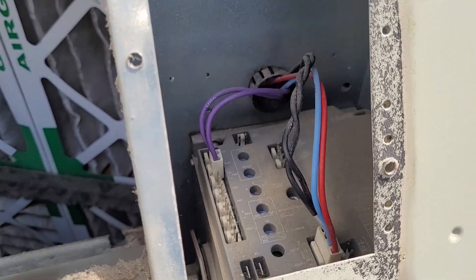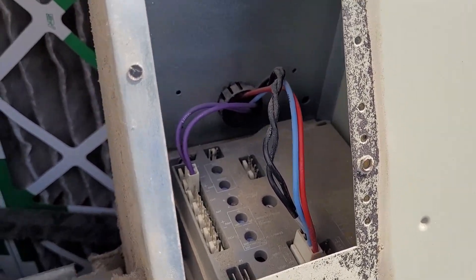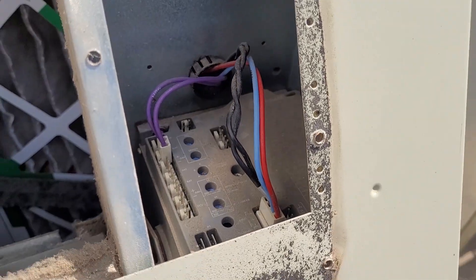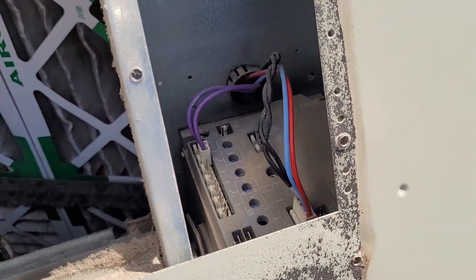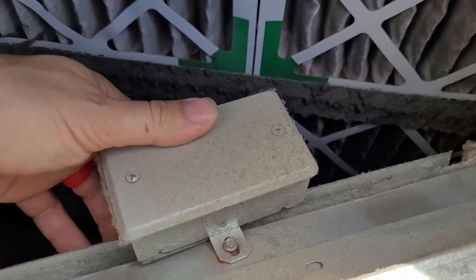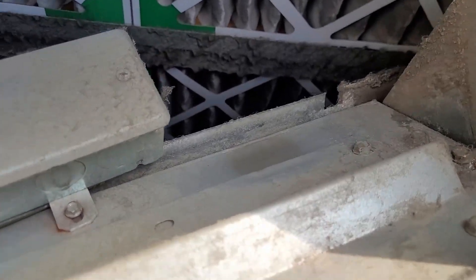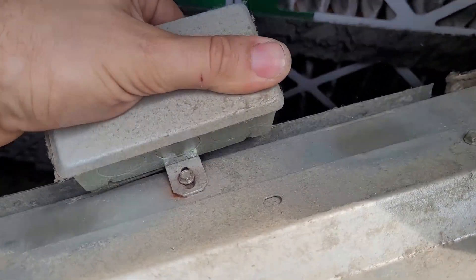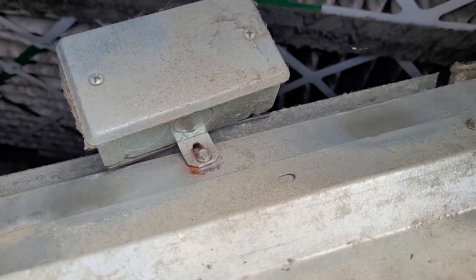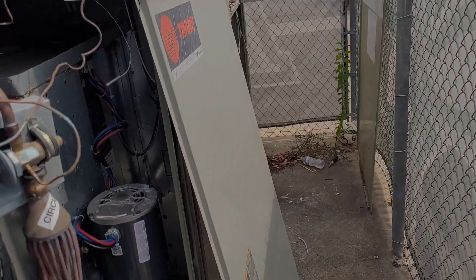You want to test your motor and make sure it's okay, but on one of these units where it's never had a mixed air temperature sensor hooked up, it's very likely the motor is still good — it's never been used. I also noticed they took a sensor and mounted it to the outside air damper, so that's going to need to be moved because it won't work bound up like that. ReliaTel is good stuff — easy to work with.